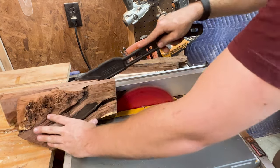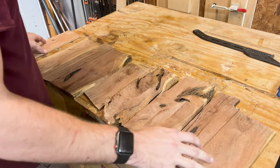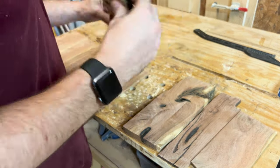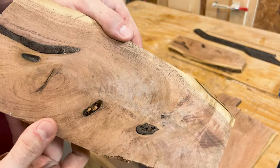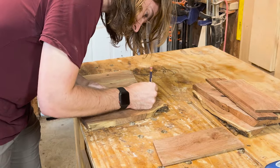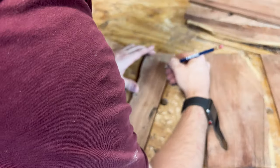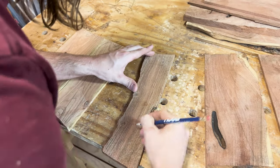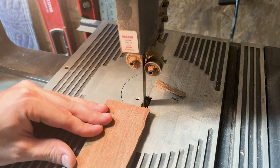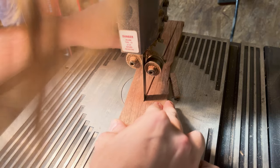After everything is cut, I make sure to find the pieces with the least number of cracks and that are the right dimensions for the utensils I'm trying to make. I settled on the five best pieces and begin to sketch out my designs. I didn't have to be super precise — the only thing I was really worried about was making sure that the handles and some of the heads were symmetrical. I'm pretty good with shaping and I've spent a lot of time using carving discs and low grit sanders, so I was pretty confident I'd be able to get what I wanted. After I had the general layout and design, I headed over to my bandsaw to rough cut the final shape into these mesquite blanks.